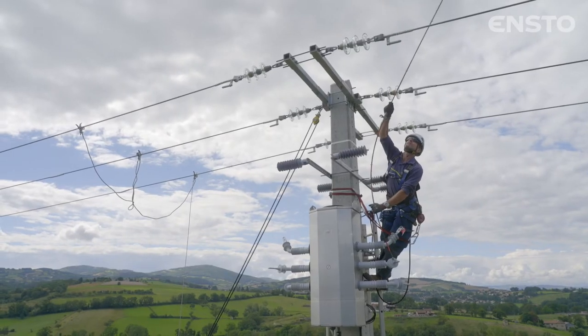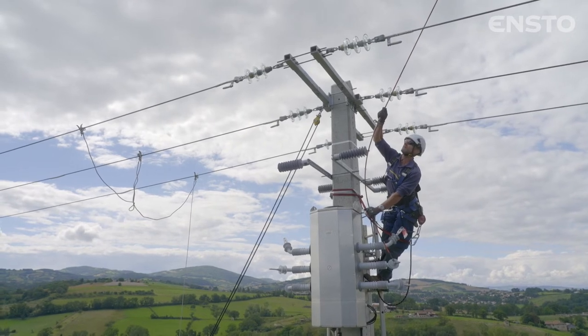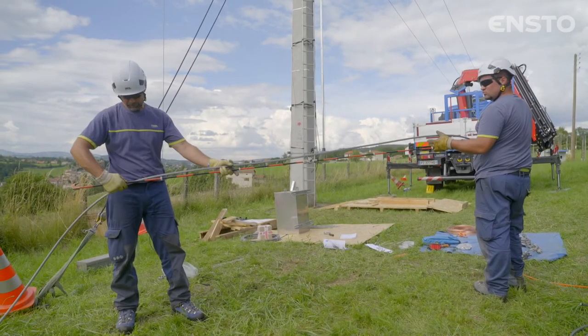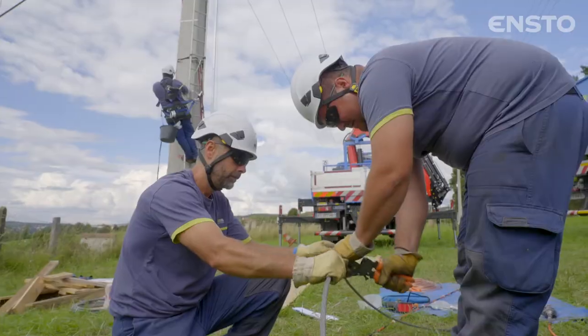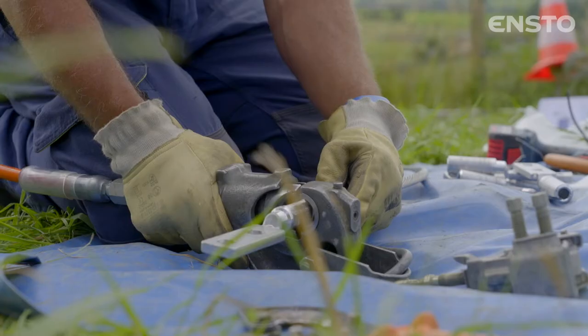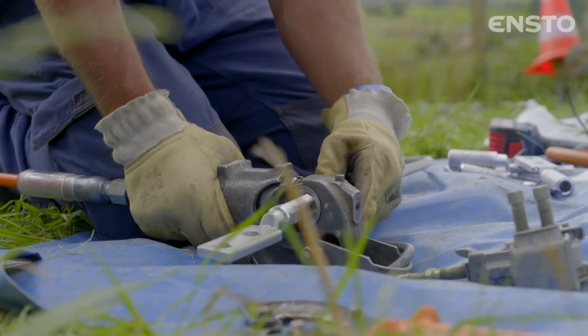After measuring the distance between the NEMA lugs of each of the bushings, lightning arrestors, and the line, cut 6 cable lengths. The switch and lightning arrestors are connected to the line using 6 jumpers made from Almelec cable, and 6 dual hole aluminium crimp lugs with a cross section of 117 mm². Place 1 crimp lug on one end of each of the 6 jumpers.